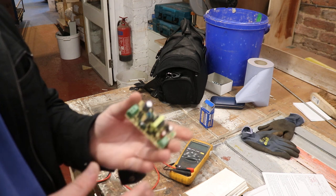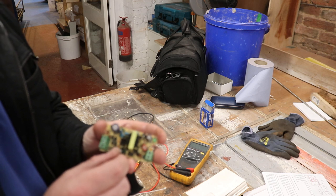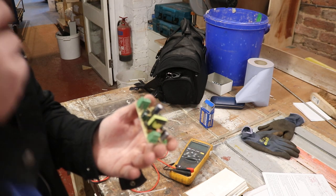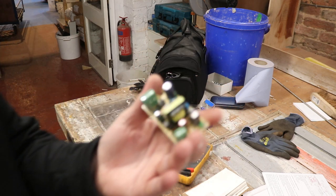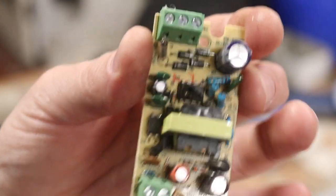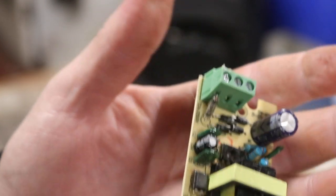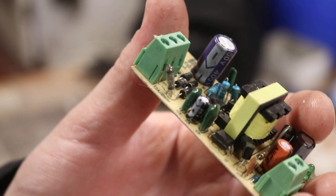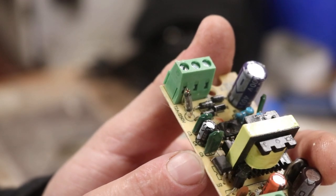And I noticed that the last beer that we made last week, on Friday actually, the best bitter, the temperature was at 21.9, and there's no way it should be getting that high with the regulating effect of the coolers that we've got. It turns out that the 12 volt power supply had let the smoke out. So basically the chiller was working fine, but the valve that allows that cold glycol to run into the tank hadn't been activated because the 12 volt PSU had given up the ghost.